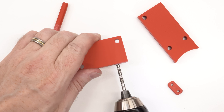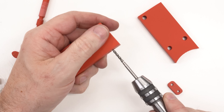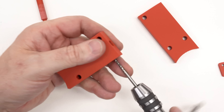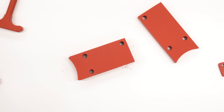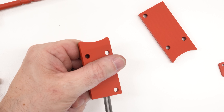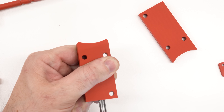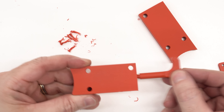The block looks good, but with these small holes the dimensions really matter, so I'll drill it out with the correct size drill — it mostly just cleaned it up to be smooth and cylindrical. Then I'll run an M3 tap through the threaded holes; the printer just can't print M3 threads. The bore on the pin is also very tight, so I'll run a 5/16 inch reamer through that slowly, being careful not to melt the plastic. With that reamed out, the fit is beautiful.